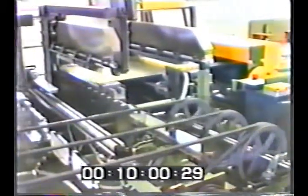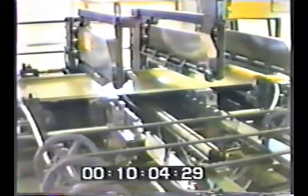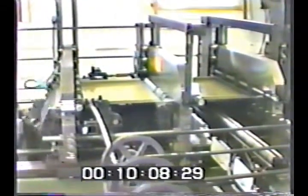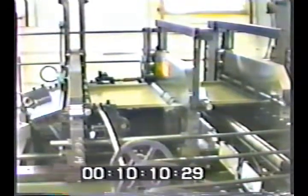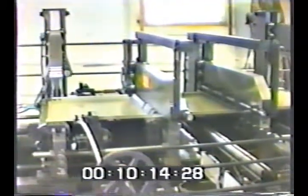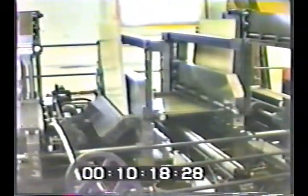Once located, the former is sequenced. It will form the 90-degree flange on both ends, then form the panel into a completed three-sided wrapper. The part is then ejected onto an exit conveyor to the next operation. The former upper ram on the forming unit is notched to accommodate the four-width variations.